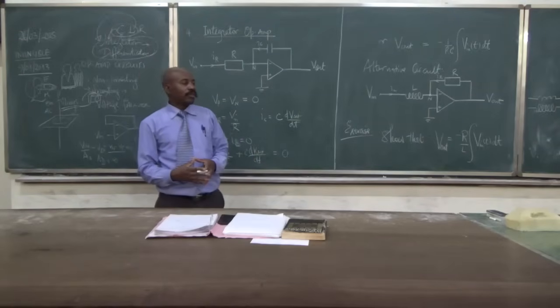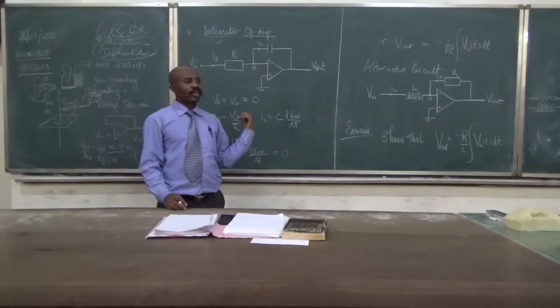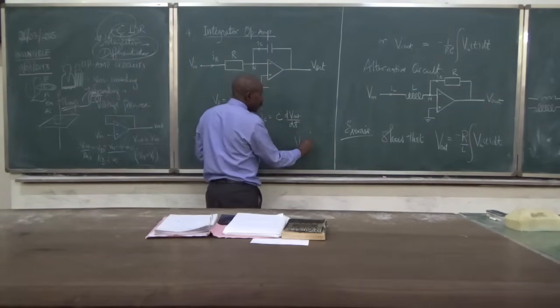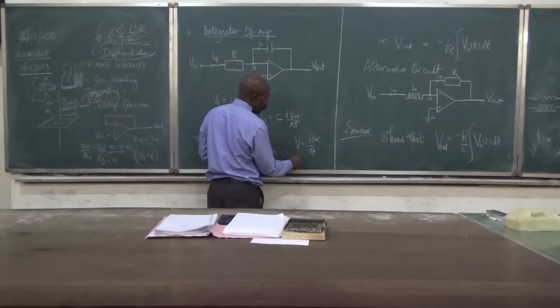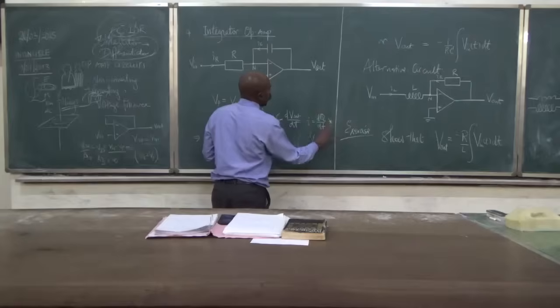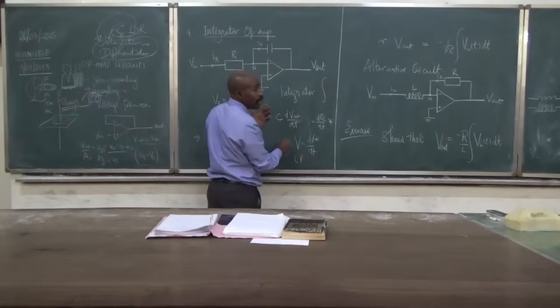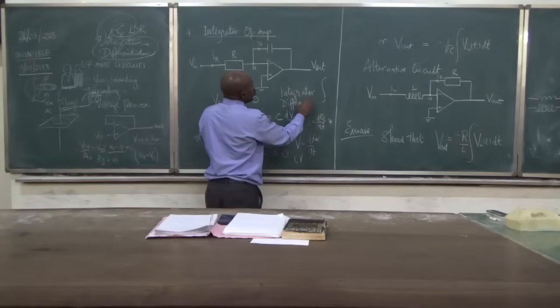For the case of the differentiator, instead it is the reverse. Put the inductor the other side, and the resistor goes this other side. Because of the idea behind the V being the same as L di over dt, whichever way you want to define that, and the CV, when we are looking at the I. My issue is about the integrator in terms of where do we update it, how do we come up with the integral, and then the differentiator, the d/dt.